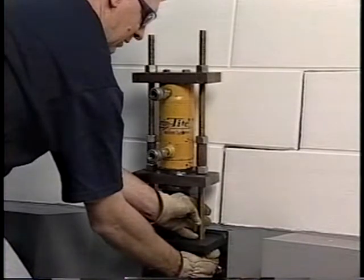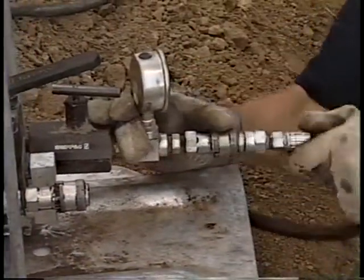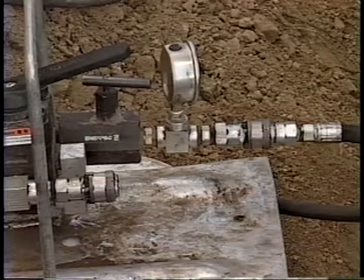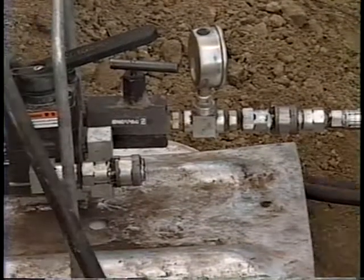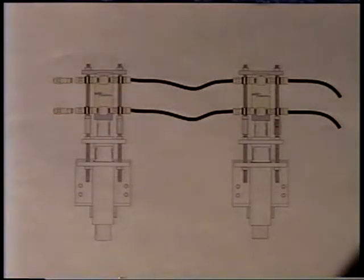If you are going to use a hydraulic ram to lift, all you need to do is reattach the hydraulic ram to the bracket. Once you have a lift cylinder or hydraulic ram on each of the piers, connect the hydraulic hoses to each of the lifting devices in series. Start by hooking the first hose to the coupler on the gauge side of the pump and the other end to the closest side coupler of the top control valve on the lifting device. The next hose connects from the other coupler on the pump to the closest coupler on the T on the bottom of the lifting device. Continue hooking hoses from one lifting device to the next in series — top to top, bottom to bottom. Once all hoses are connected, place the dead end plug in the open end of the last lifting device.